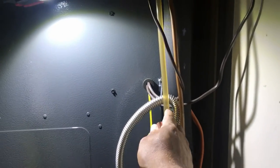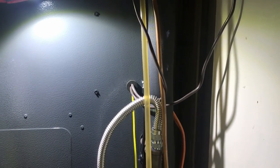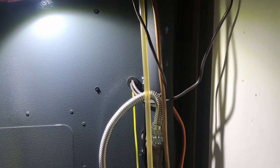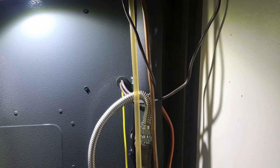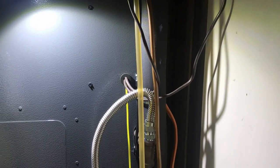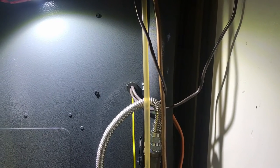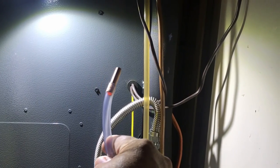You can see that flexible line right there — squirrels are notorious for causing a lot of damage and costing the company a lot of money. They'll eat that line in the attic when there's sufficient water; they can actually smell it. I was instructed to go in the attic and fix the line, but I'm not going that route — once you fix it, the squirrel already knows where the line is and will just chew it somewhere else. I've seen it happen several times.